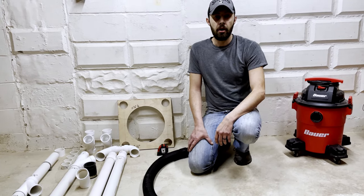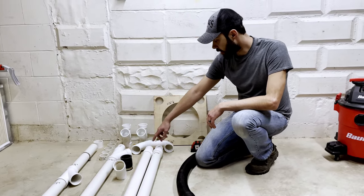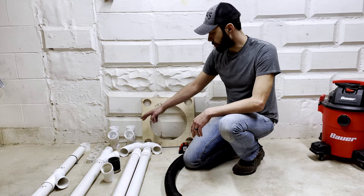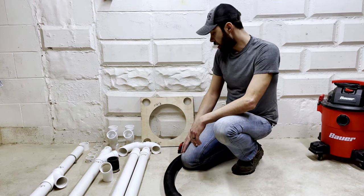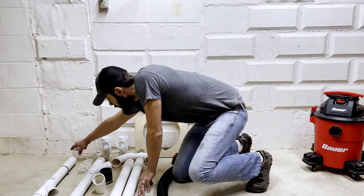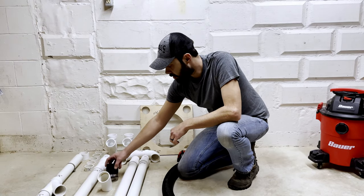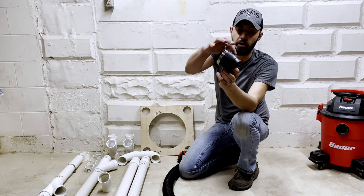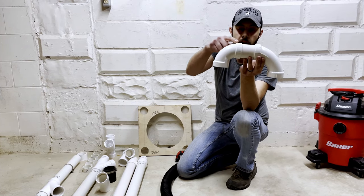You'll need about 12 feet of two-inch PVC pipe, four Y's depending on how many accessories you'll be putting in — you'll see in the video how I use those. If you're not going to use accessories, you'll only need one. You'll need one repair coupling — the two-inch repair coupling so it doesn't have a stop in the middle — and two-inch street 45s, make sure they don't have a hub on both ends. You'll also need a two-inch Fernco coupling, also called a hubless clamp — you don't want the one with the steel banding around it — one long sweep 90, and then a regular 90.